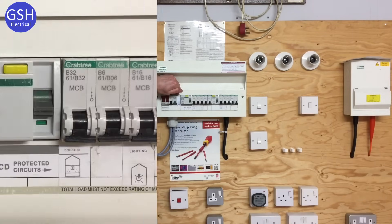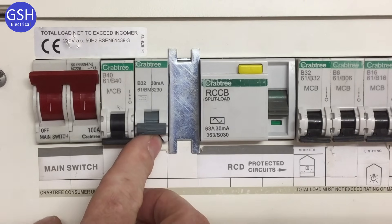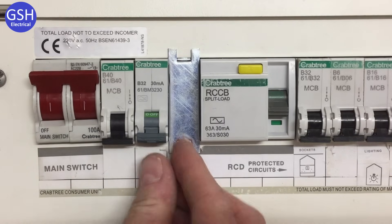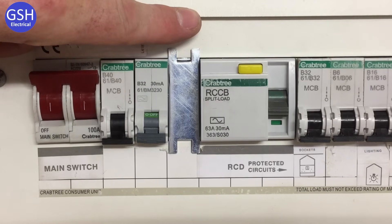Moving in closer for a clearer view: I turn the socket circuit on, press the test button, and the socket circuit goes off. Moving my finger away you can now see the word 'off' — but it was already in the off position. Likewise, if there is a fault in the circuit and you physically try to hold the switch on, you won't be able to — you'll only hold the switch handle up while the mechanism drops out. Pressing the test button, the mechanism drops out and the socket circuit is off even though we can see the word 'on'; remove the finger and it falls to the off position.